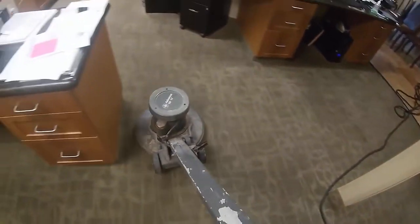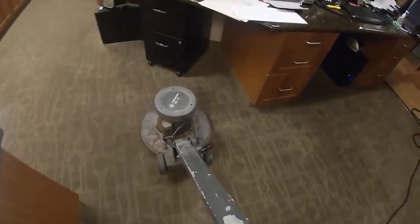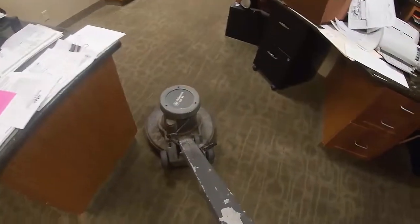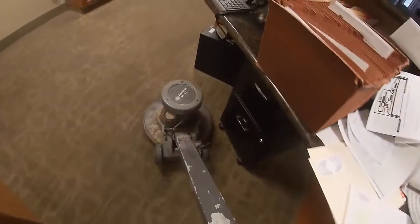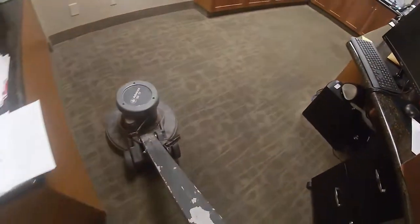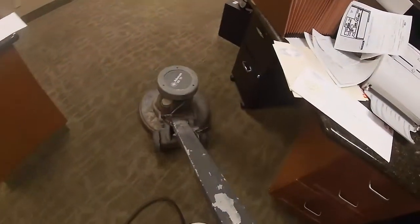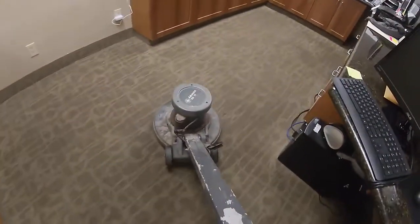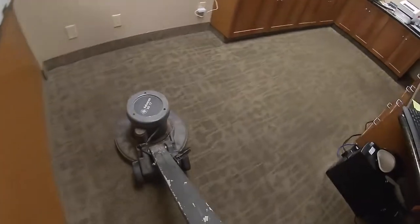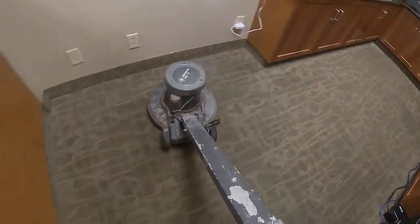And it's about 300 square feet, maybe 400 on the outside there. So it doesn't take much, and that's spread out. That 2 or 2.5 gallons spread out over 300 feet will be dry shortly. One hour, two hours, typically it's going to start to feel pretty dry. And in fact, when I'm doing large areas, I can only spray so much because I have to make sure it stays sufficiently wet for the 15 minutes it takes me to get to the area that I'm going to be cleaning. And it will start to dry out if I spray too much down at one time.